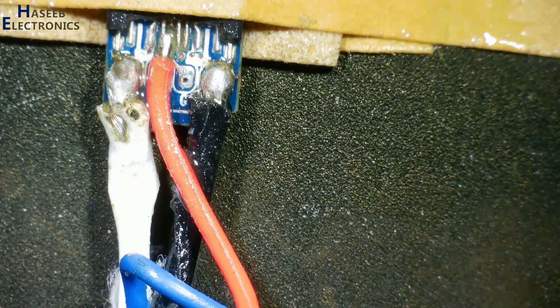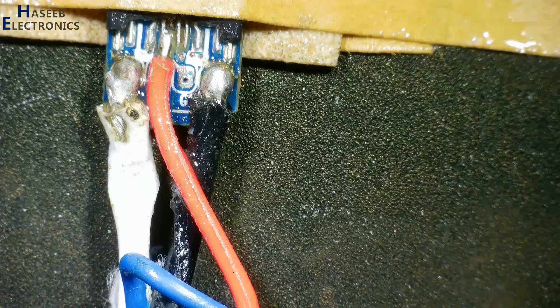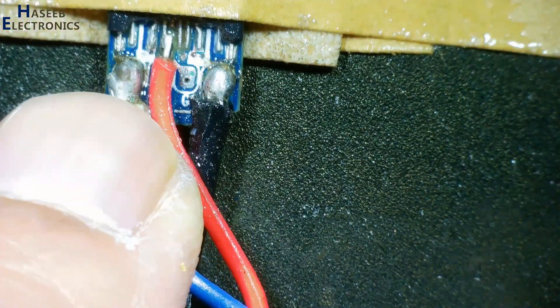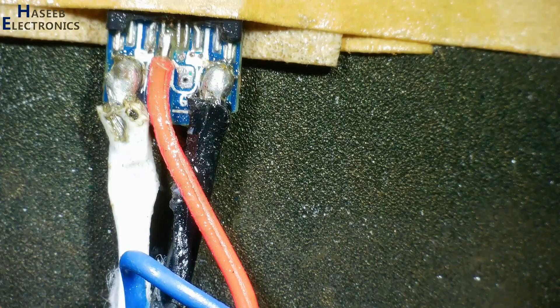In this configuration, if you connect a simple USB phone with a type-C connector, it will provide 5V. If you are using a smart charging phone, it will provide 9V. If you are connecting a power bank or a 12V source, the same connector will provide 12V. If you are connecting this charger to a 15V notebook, it will provide 15V output. And for this laptop, which is 20V, it will provide 20V output.